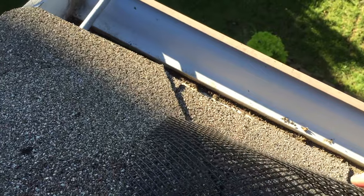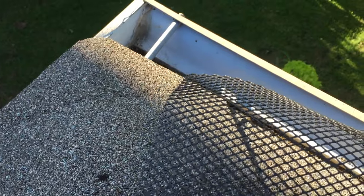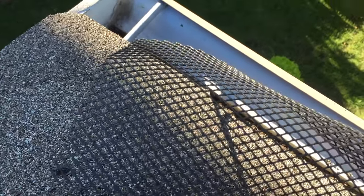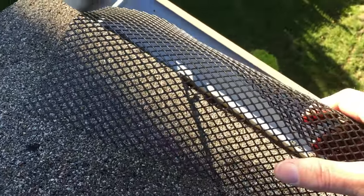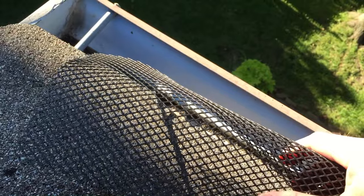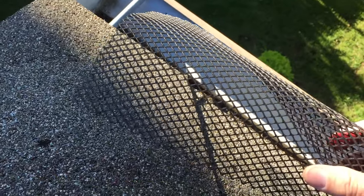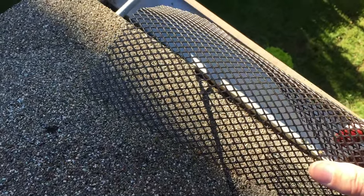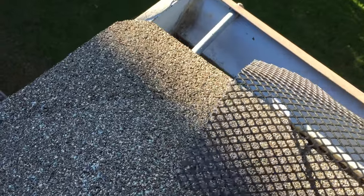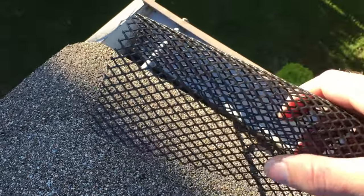This video shows you how to install the Frost King gutter guard screen. The instructions tell you to cut it into manageable pieces, which is probably okay, however I think it's superior to leave it as the full length, which is 20 feet. It's a little problematic when you come to joints and lining them up, so leaving it at full length tends to minimize how many connecting joints you have to make.